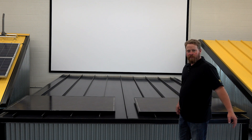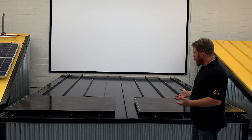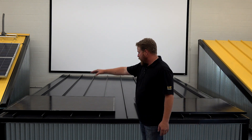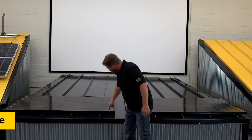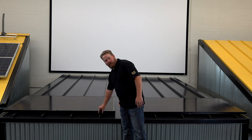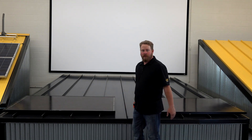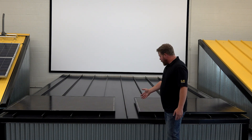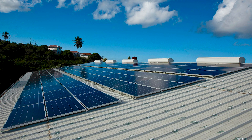We've laid some panels on this roof just for purposes of this demonstration to show you different layout methods and nuances of those methods. What we've done here is I've tried to center the panel pretty much on the seams to help keep it square going up, and also my attachment point on the panel would be the same on every single panel. You may see a little bit of difference where you're attaching here at the eave, and then up at the ridge you might be over a little bit — it's just that the panels are going to stay square where your roof may not. The other thing about this method is it leaves me an access and a correction gap where it makes it a little harder to see that the roof may not be square with the panel.